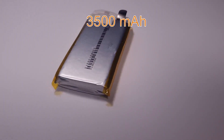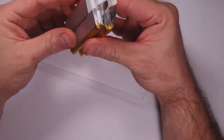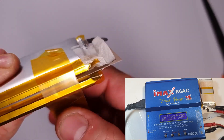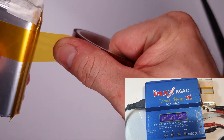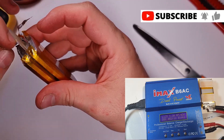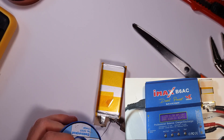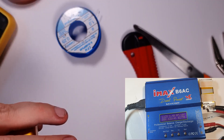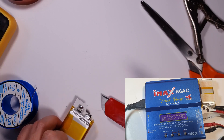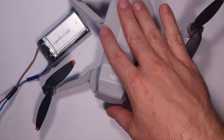These are the cells I'm going to use — I brought three different capacities and we're going to see how they perform. They will be added to the original battery and tested. While I'm putting together the first series connection, you'll see the cardboard — a very important safety point that helps you avoid shorting your battery. I'm doing a capacity test of this cell, which should be 3,500 mAh. As you can see on my balance charger, it delivers 3,509 mAh — so it lives up to the promise.